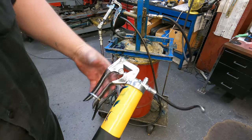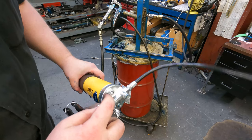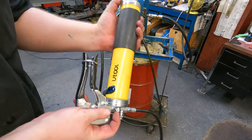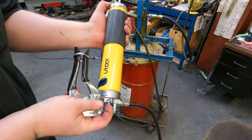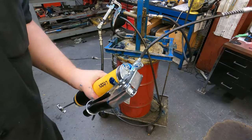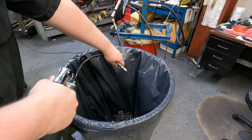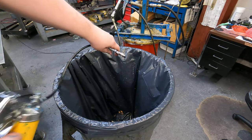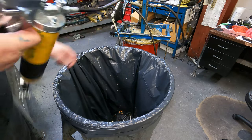You don't have to get it super tight — you don't have to get a wrench on this thing. What I'm going to do now is press in on that button and release the plunger. So we've got some grease coming out — now we should be fairly primed and ready to go. We've got grease coming out, so this is ready.